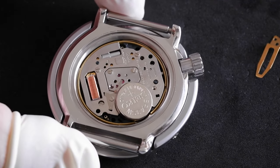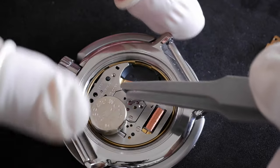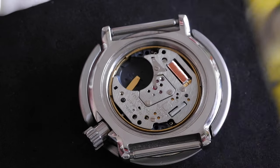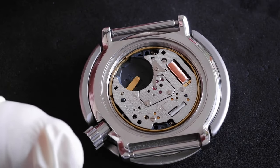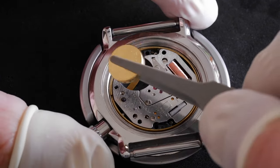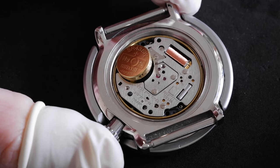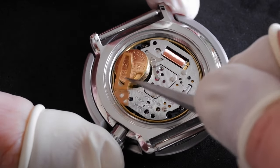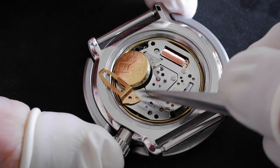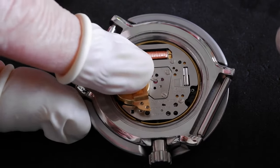For handling the battery - even though this is a dead battery - I still like to use plastic tweezers for any kind of batteries. This movement needs the SR43 SW, and it needs silver oxide, not alkaline. Alkaline will run down faster and may leak if they're not from a brand you trust. Make sure you get a good quality brand silver oxide - don't try and save one or two dollars on a cheap brand that is worth less than one percent of the value of your watch and yet could ruin it.